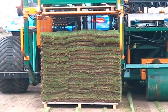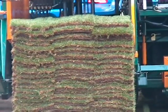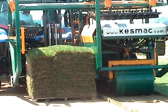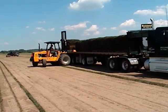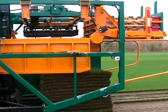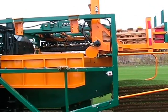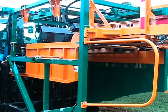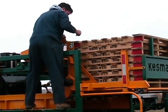The unique stacking process interlocks the pallet of slabs up to 720 square feet by offsetting the layers in two directions. In addition, the hydraulic piling wall creates additional support, tying in the ends of the slabs together to produce a stable and neat pallet, while maintaining the desired skid dimensions. This reduces transport space, which is more money in your pocket — more productive and more profitable. The pallet injector is standard equipment, holding between 15 and 18 pallets. The pallet injector system transfers the pallet quickly and efficiently, allowing for less than perfect stacks of pallets. Empty pallets are positioned squarely in the piling area by the hydraulic piling wall. The pallet injector folds down to gain better clearance during storage or maintenance.